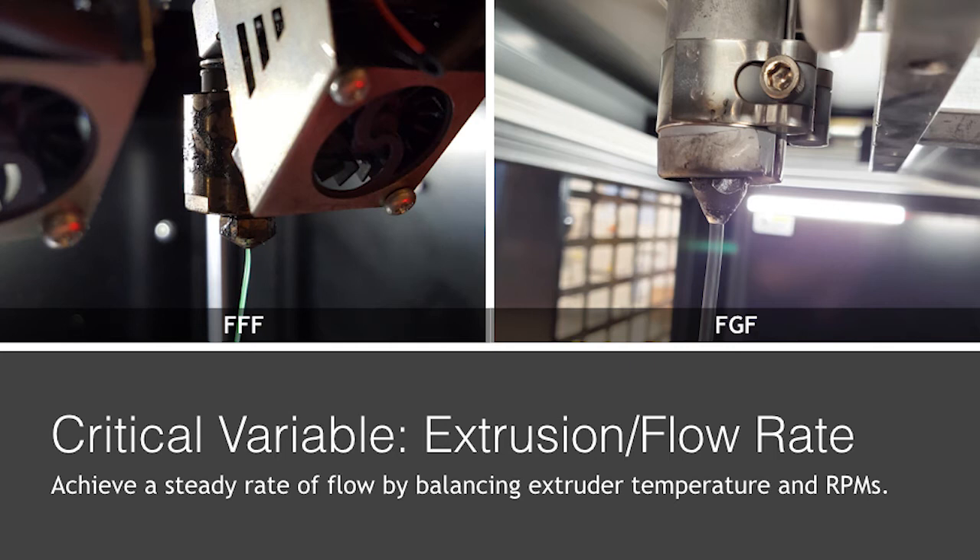The procedures for FFF and FGF are similar as they are both processes of extruding thermoplastics. Other than the mechanics, the only real difference is the scaling. The manufacturers of the filament or pellet material help you out by providing a range of temperatures to start with. It's virtually impossible for them to provide an exact temperature since each 3D printer manufacturer uses different equipment and temperature sensors that can provide different readings. To avoid degrading any material, it's always smart to start at the lower end of the range. While testing temperatures out, you'll be looking for a constant flow showing a very consistent diameter. If there's any interruption of that flow, take a look at the feeding mechanisms. If the material looks to thin out after extruding or drools out of the nozzle, you may be too hot and want to cool it down.